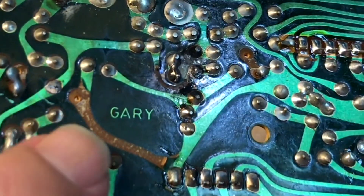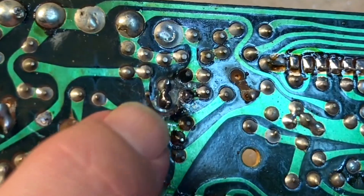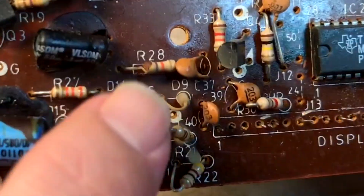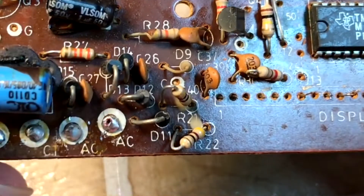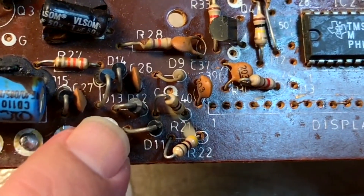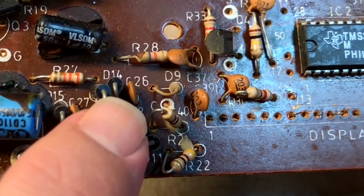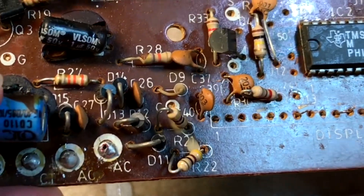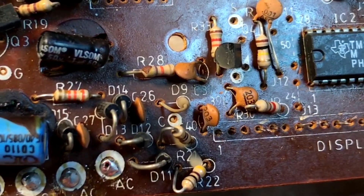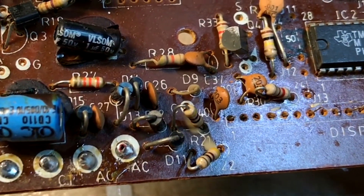This is mechanical damage caused by me ripping the wire out - sorry Gary. But right there is the burnt melted hot spot. This looks to be a full rectifier, older style - got four diodes, a couple of smoothing caps, and then a filter cap. That is what failed on the GPX.